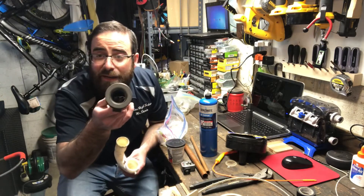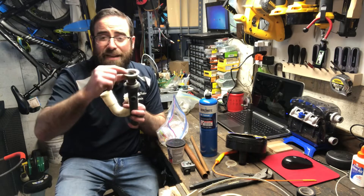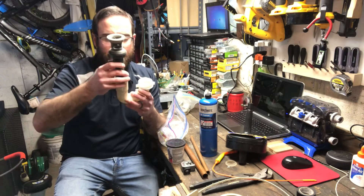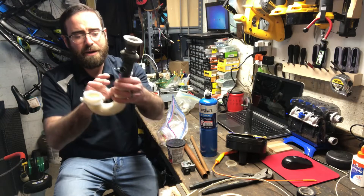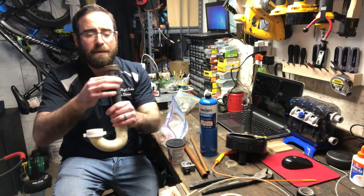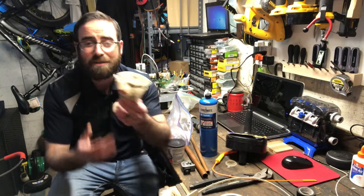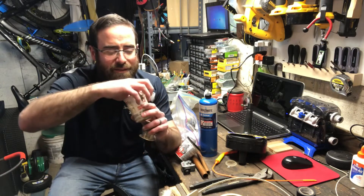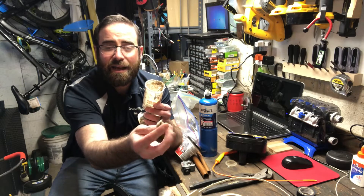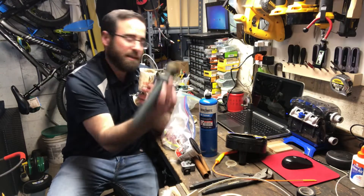This piece — you might recognize it — is where the drain stop inside your sink goes. That's basically the only visible part; the rest goes below into your trap. There'll be a clamp on here that holds it in place and the water sits in your trap. Here's my plumber's putty — it almost looks like play-doh, it got a little smashed at the bottom of my bag, but it's still malleable. That putty goes under the drain of the sink to help seal it to the sink itself.